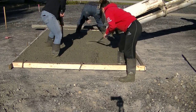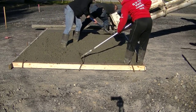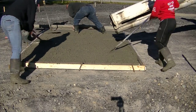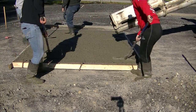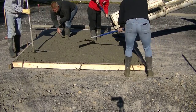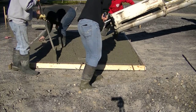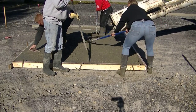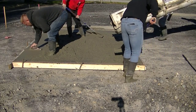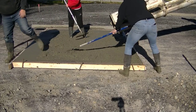This takes just over a yard of concrete at 4 inches thick. We're actually pouring another slab on this site — a big patio — so we just ordered the concrete out of a ready-mix truck. If you're going to mix it by hand with bags, that's going to be quite a few bags, probably 60 to 80 bags. If you order like a yard and a half or two yards, you're going to pay quite a bit plus a small load charge depending on where you are. But the good thing is it's fast and a lot easier than mixing by hand, so you've just got to weigh the two options.